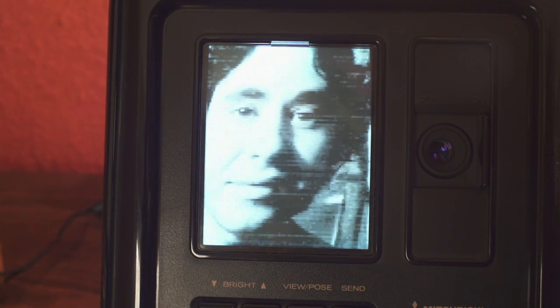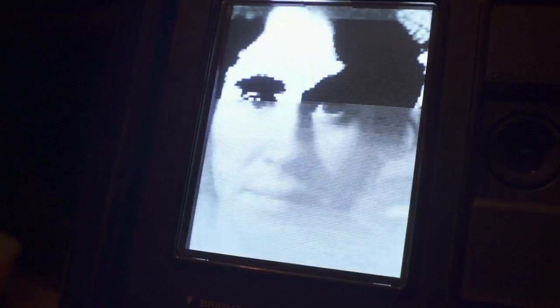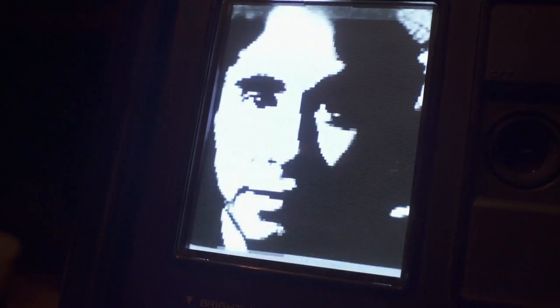Let's see if we can do this again. You can adjust the speed of the tape and make wiggly lines. There we have it. Okay, got the pitch right. The contrast of the image can be adjusted by turning up the volume right after the original header information is sent. Or inversely, it can be lowered.